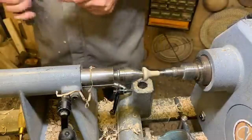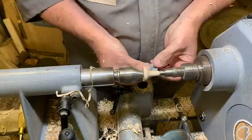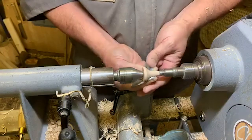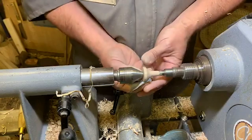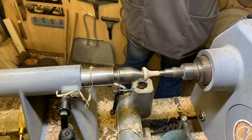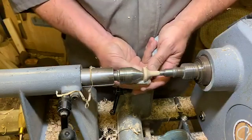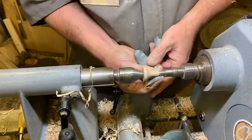I'm not going to pretend that it's a short journey to get right or competent with a skew chisel. It takes a bit of practice. A lot of skew chisel issues come from a bit of nervousness, because when it catches, you're concentrating and it makes you jump. Still makes me jump if I get a catch. It's practice, and then a bit more practice. But yeah, keep that handle in line, bevel rubbing, your hair all over the place. It's key, really is key.